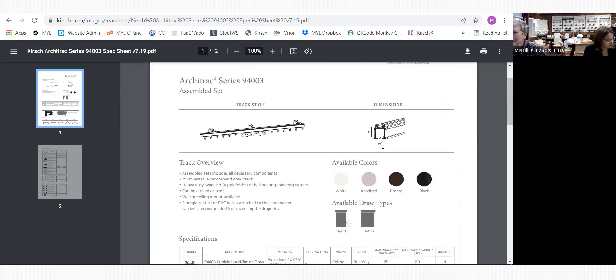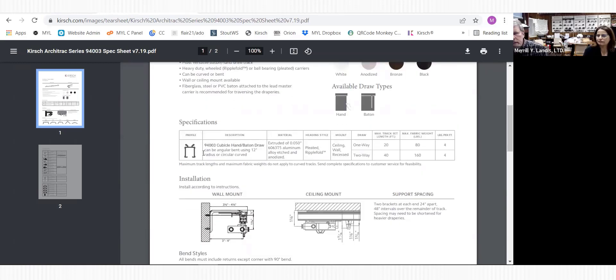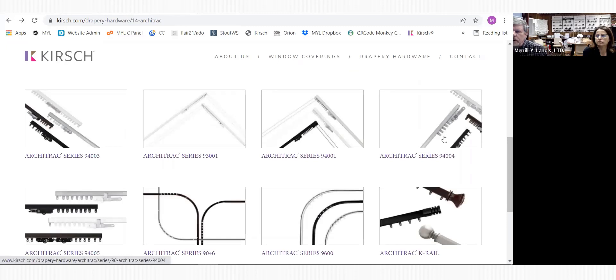For pinch pleat, some customers pin the drapes lower so the drape hides the track, though your fabric is then wearing back and forth on the metal track itself - the top of your drape might lean forward a bit. One thing I've heard from installers is that they like this track compared to the other two because when installing on the ceiling it's very easy to put up individual ceiling brackets and then lift the track up and lock it in place. From the feedback I've received, this is a track a lot of installers prefer.